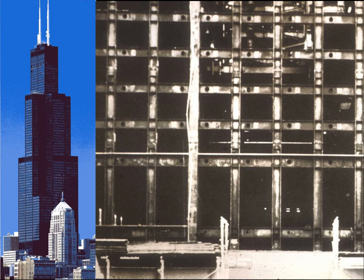This tubular concept allowed portions of the building to be dropped off earlier, which changed the cross section as the building went up — which, as the people at SOM say, confused or detuned the vortices. These tubes were also terminated at lengths where the natural frequencies of the tubes tended to suppress each other, which reduced the tendency for wind-induced oscillations to cause any serious disturbances in this building.